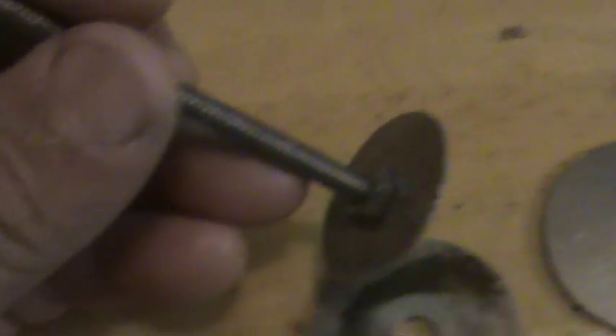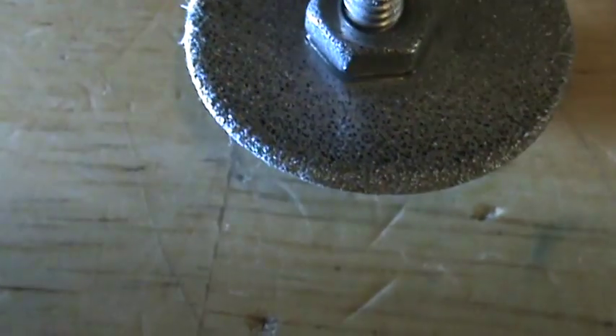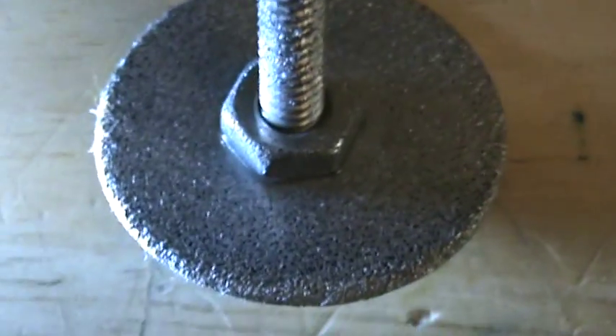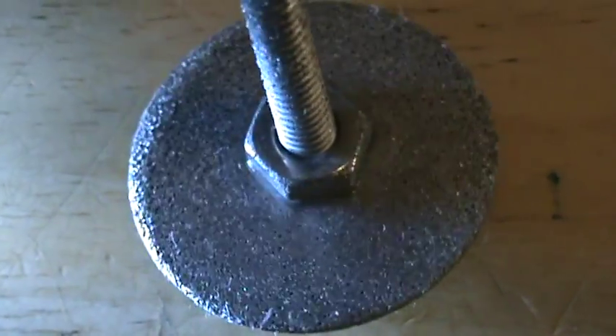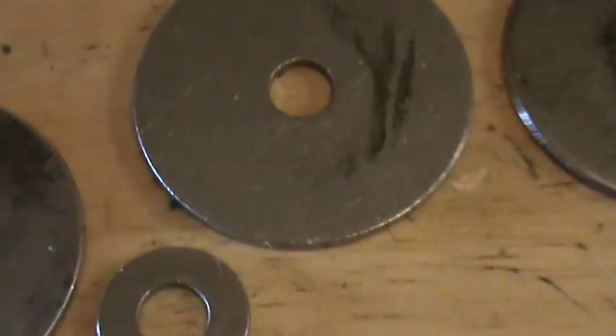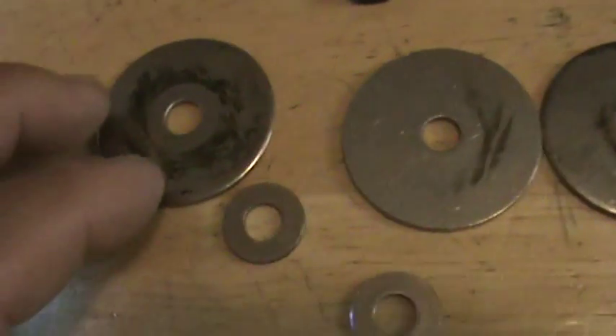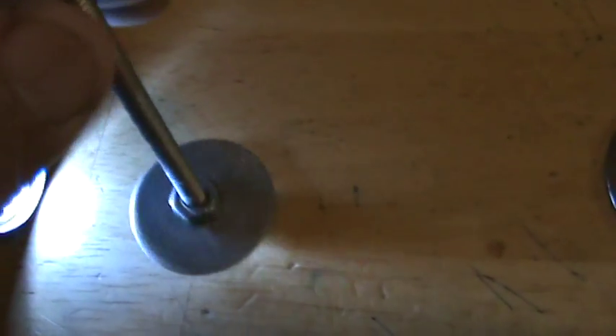On the positive side, what it does is it eats the metal up like crazy — it just pitted the hell out of the metal. Only on this one side, on the edges, it just ate it up like crazy. That's after 40 minutes of running with one tablespoon of table salt. This is the positive side. So if you're going to use table salt, just a warning: it will make your plates turn really dark green and very hard to clean, and your positive plates it will eat them up like crazy.